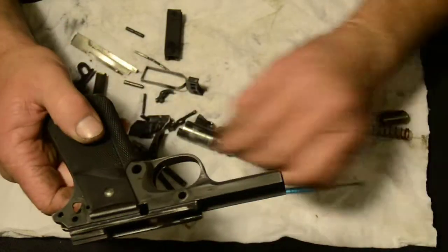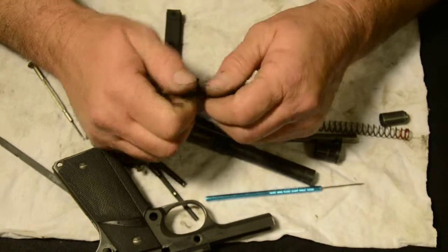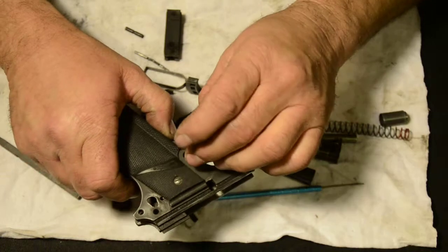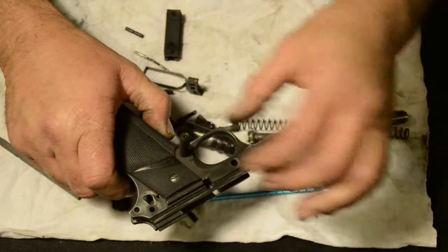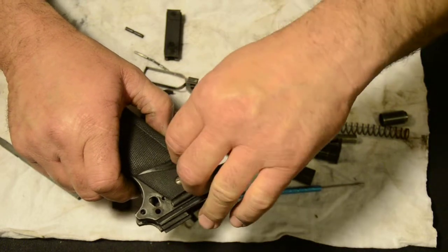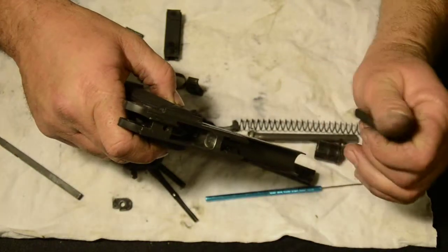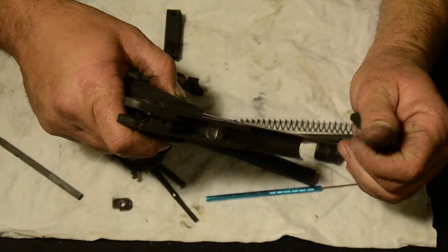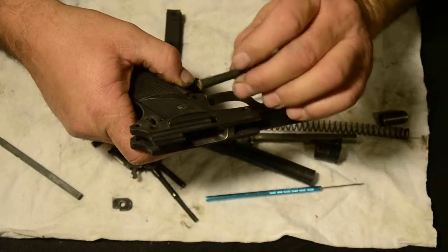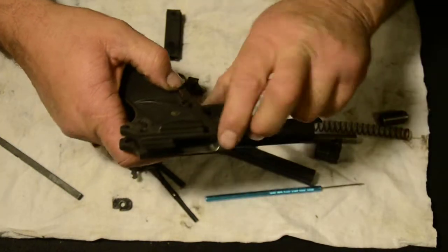And the frame, we use the roll trick for the 600 grit sandpaper, and we polish the inside of the mag catch the same way we do everything else. We let it loose and then we turn it the opposite, twist it the opposite direction that we rolled it, and it forces it out tight against the hole and polishes the inside of the hole. You can do the same thing to the plunger tube, but man, it takes a tiny little sliver of sandpaper to get inside that plunger tube. But you can do the same thing there.